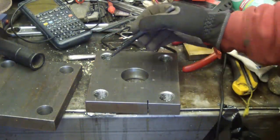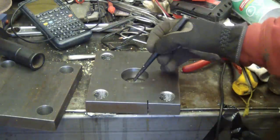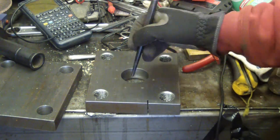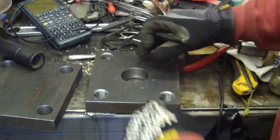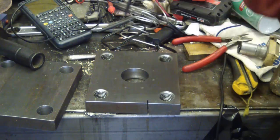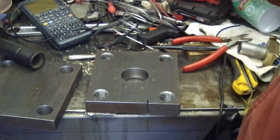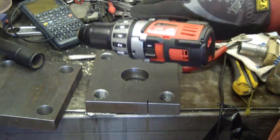We've got our bottom plate marked off on the workbench, center-punched eight holes. We're going to drill them to a quarter-inch, then put it in the mill and mill them to a flat bottom at a quarter inch. Then we're going to epoxy in some magnets so our spreader bars or supports for broaching will be held in place. Plus it's a good excuse because I got myself a new toy.